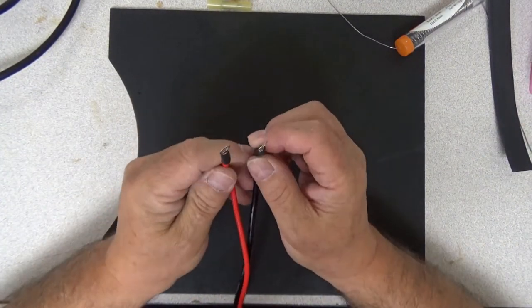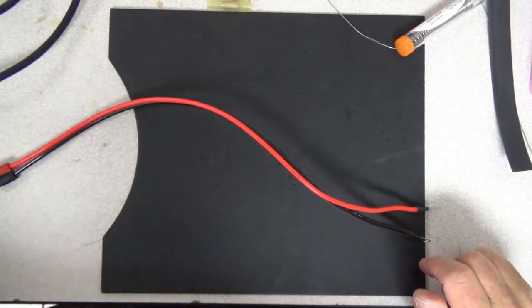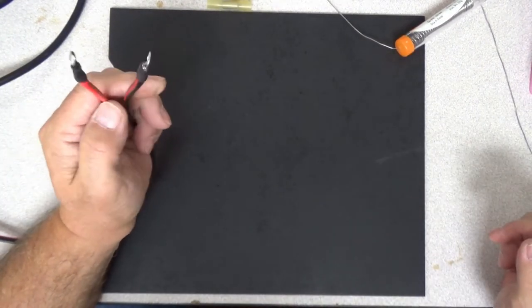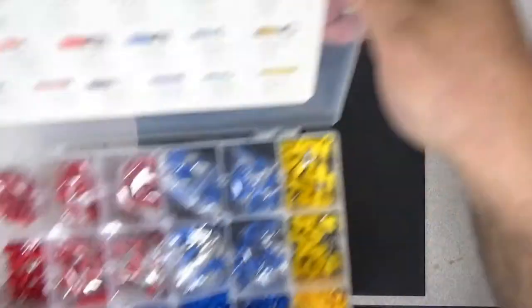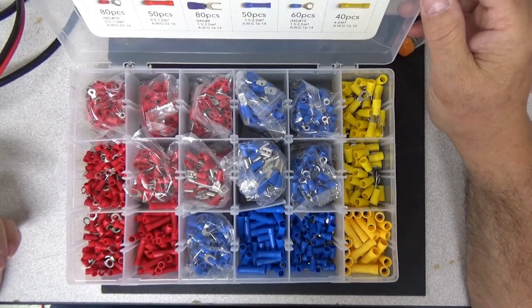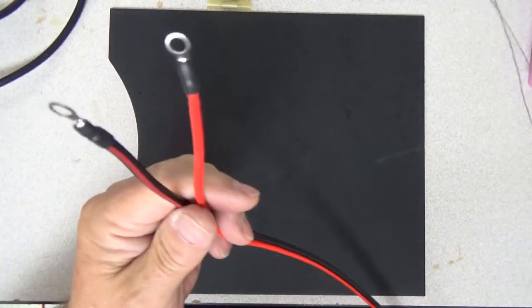If you're afraid to solder, don't be. Go out and get yourself a soldering iron and some solder and play with it. That's really all you have to do. So that's an example of repurposing some of those insulated connectors. Why do I want to repurpose it? This is a $9 to $15 assortment of these connectors from Amazon, and to be honest with you, in the ham radio environment they're just not reliable enough to be crimps. That isn't because they're super cheap — it's just because of design.